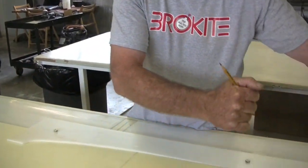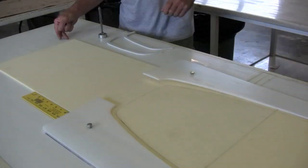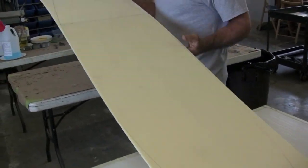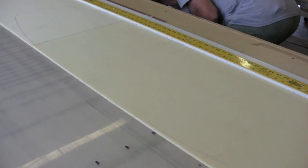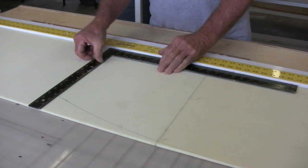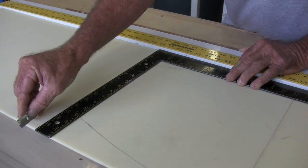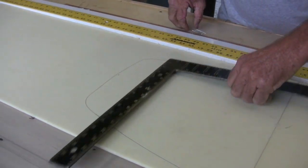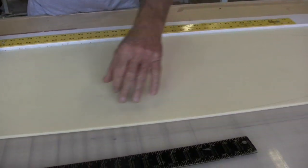To get the core shape, we used to route these out with a big industrial router — throw a template on top and run around with a big router bit making a lot of noise. Now we're getting the exact shape of the core of the board. Once we've got it marked, we pull out the core and bring it over to our marking table. This is where we mark where all the inserts go and where the five sections of the core are. If you've seen the first video, we used to do four sections, but we've increased that to five sections now.